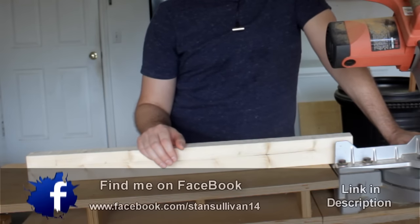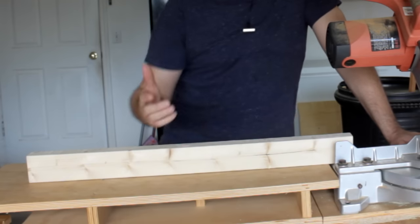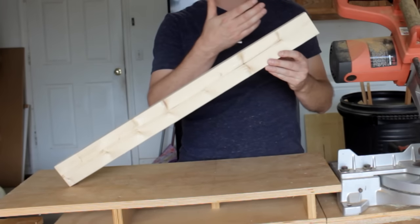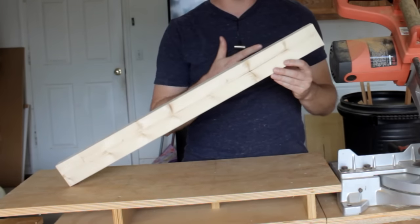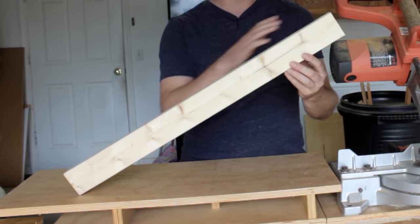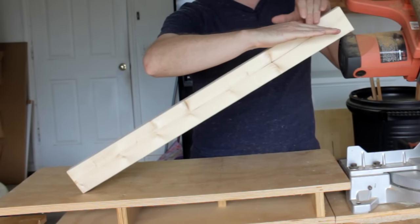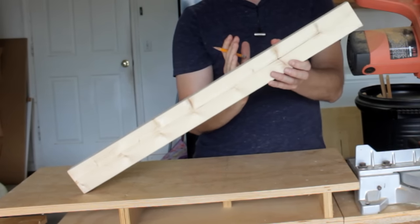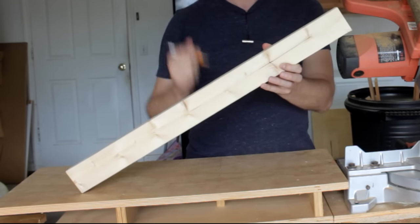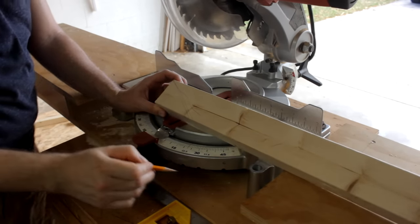So I always leave a board an inch or two longer than what I finally want. There is nothing more frustrating than cutting the angles only to realize you did not cut them in the right direction. When you are first starting out, it is helpful to place the boards at roughly the same direction and angle they will be used in the project. In my case, this is roughly the position I need. Then I simulate the adjoining pieces — there is going to be a horizontal top piece and a vertical back piece — so here I want the angle cut this way, and on this side I want the angle cut this way. This gives me a rough visual guideline to assist me from here on out.